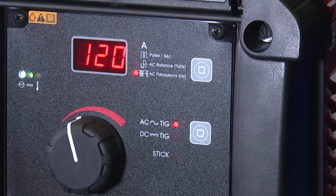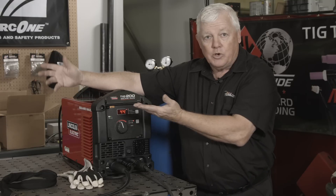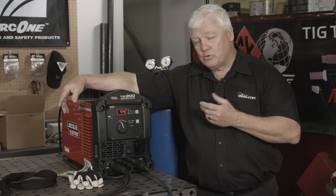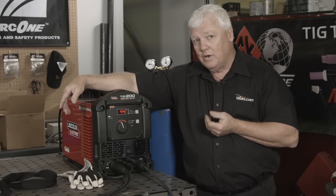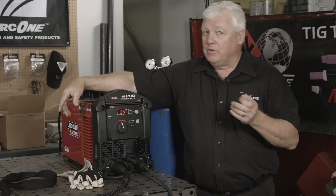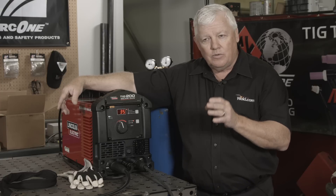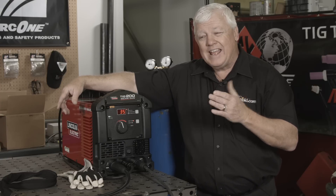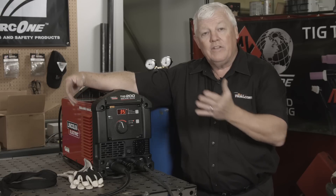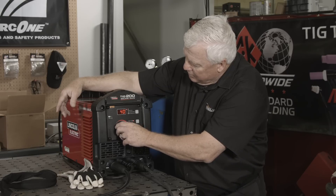There are just millions of variations you can do — I'm just standardizing this for you. It'll always go back to the amperage. This machine is rated at 200 amps. At 200 amps you only get about 25% duty cycle — that's still pretty good. The first weld I'm going to make is probably going to be in the 30 to 40 amp range. I'm going to do some really thin material — about 18 gauge aluminum. When you get down to thin aluminum, it's going to tell you the stability of your arc, the arc start, and the arc termination. When you get into heavier materials, you don't see it quite as much. So I'm going to do both — thin and thick. I'm going to set this machine at 40 amps.